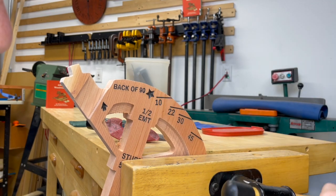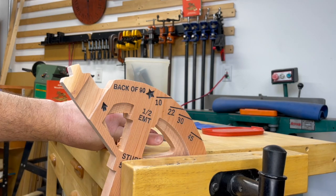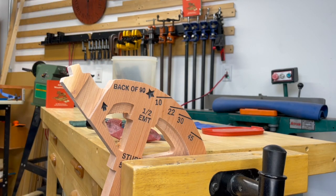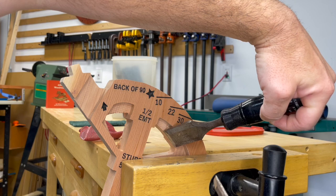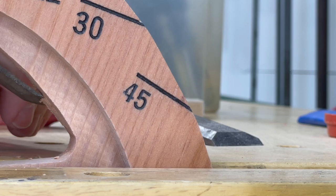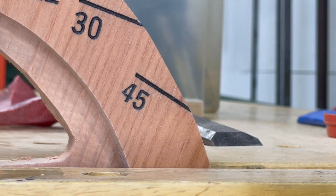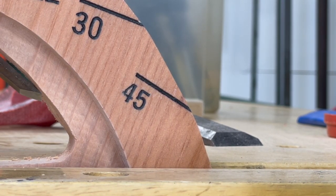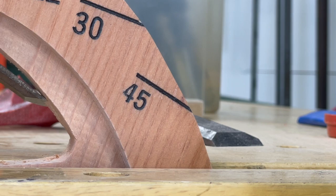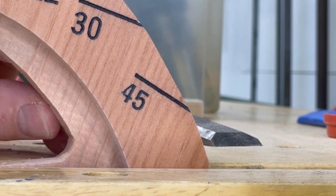I'm going to use the same process here — this one is on a slight radius with just a small tab. I'm using a half inch chisel this time so I don't create a big flat spot, chipping away just like the last one. A nice sharp chisel will work wonders. It's definitely not a race — you can see I'm taking very fine shavings. It's easy to take a big chunk out if you're in a hurry. Think of how much work you've put in so far — slow down and pay attention to the details. It will be worth it.